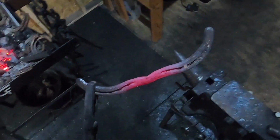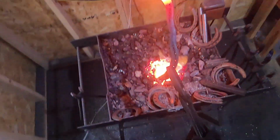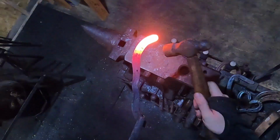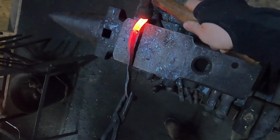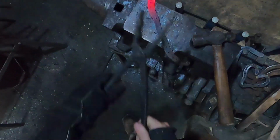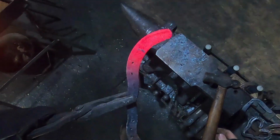After this comes the faces. Make sure you have heated up several inches there, as you will need a little bit of space to work. To first section off the nose, take it along the edge of the anvil and give it just a very little hit. See there, already starting to come into shape. There it is, a little bit better.